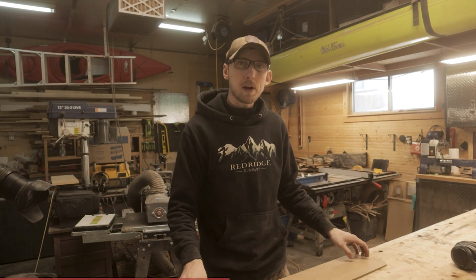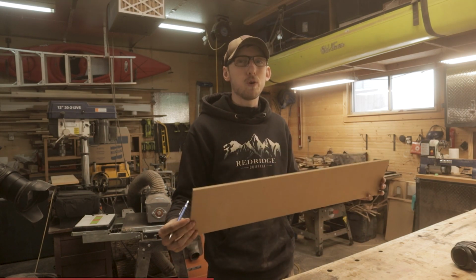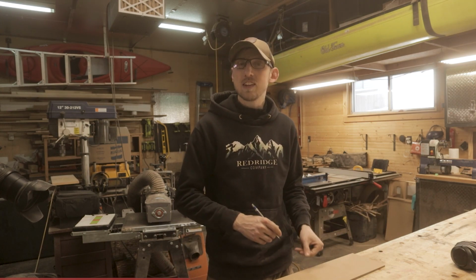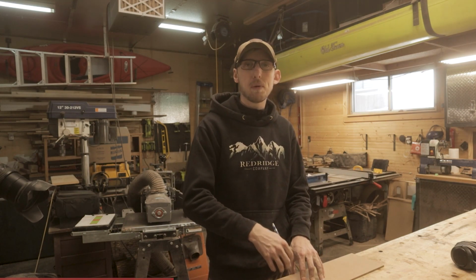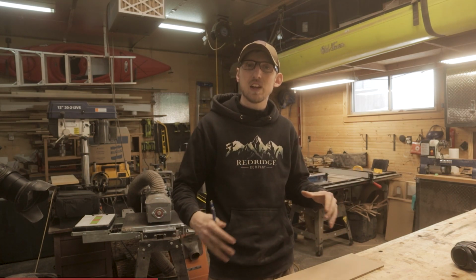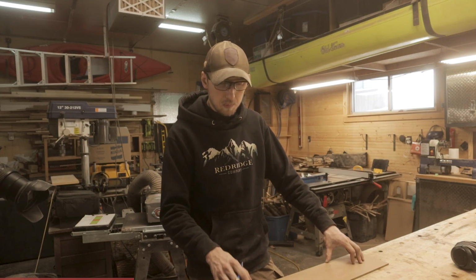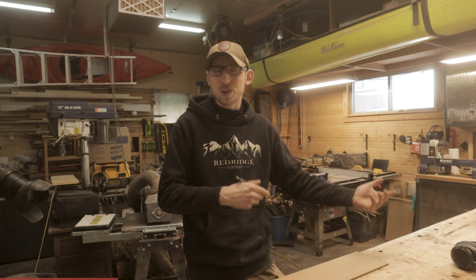And so this is gonna be one of the best parts about working with the hardboard, is because this is a super cheap material. You can buy a 4x8 sheet of this stuff for, I believe, 16 or 17 bucks at your local home store. So it's a super cheap material, and it's great if you wanna make more of these things in the future. But in this case, I'd much rather do all my layout and figuring out and roughing out my shape and all that, and just overall getting a nice finalized shape on this nice cheap material before I go into a piece of something like white oak. So we're gonna get our runner template all laid out here, and then we'll get on to actually shaping the template and getting it ready to actually transfer over to a piece of wood.